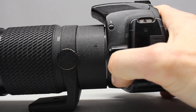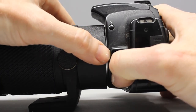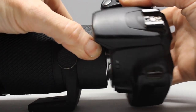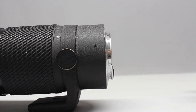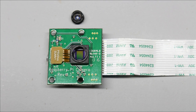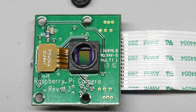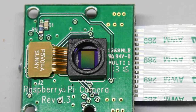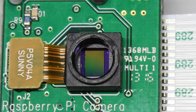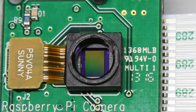The Raspberry Pi camera can't control the aperture of the lens. To get an aperture of less than f/4, which is the maximum, the lens can be removed from the camera body while the aperture is triggered through a special button. The area of the light sensor used with the Raspberry Pi camera module is clearly smaller than that of a standard camera the lens was manufactured for. We get a crop factor of approximately 9, by which the focal length of this zoom lens gets up to 2700mm.